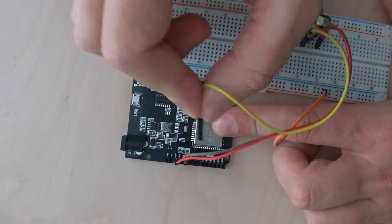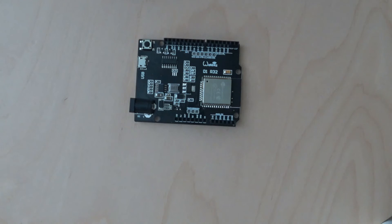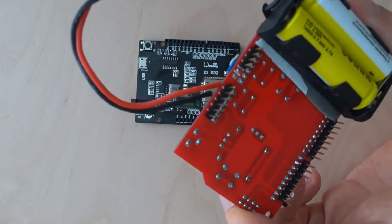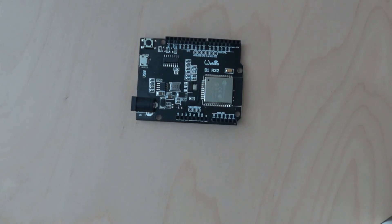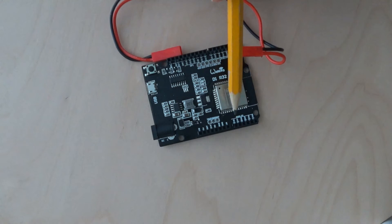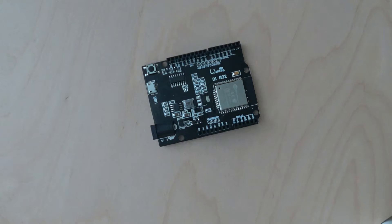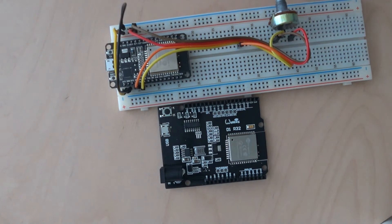I found that I can use pin number 34 and pin number 35. So in order to work with them I really needed to remove these two pins from my board and connect them to the next two pins. It took me a really long time to understand why my voltage is different on different pins. That is why I don't recommend this UNO board. Instead of using it, I would recommend using a breadboard with just a simple ESP32 attached to it.